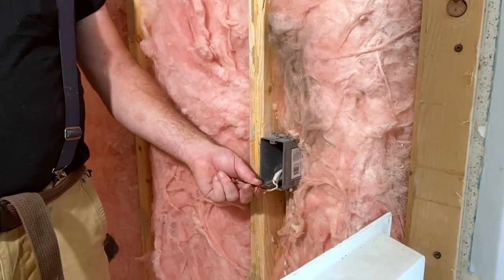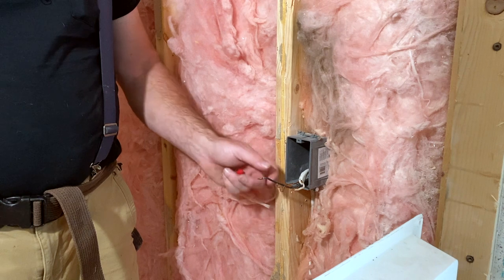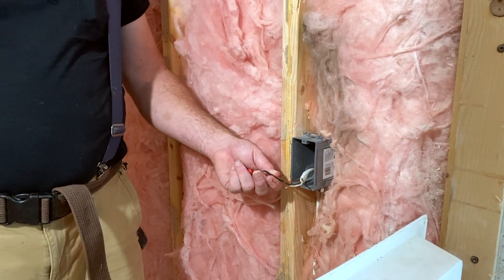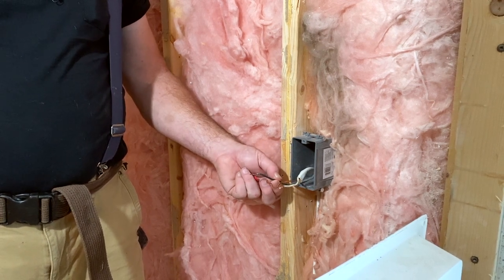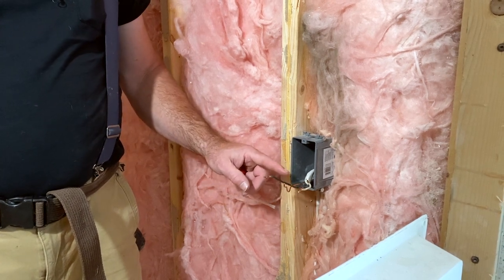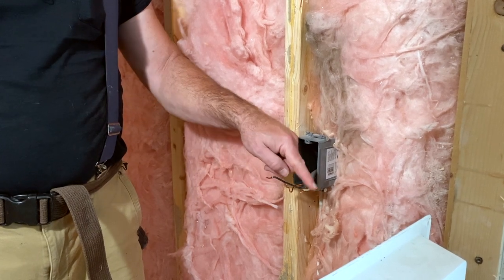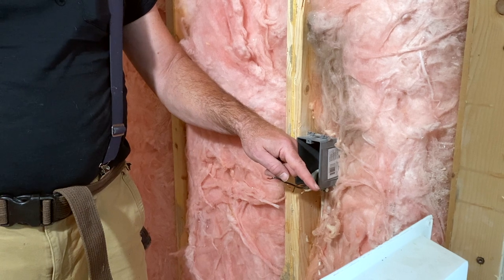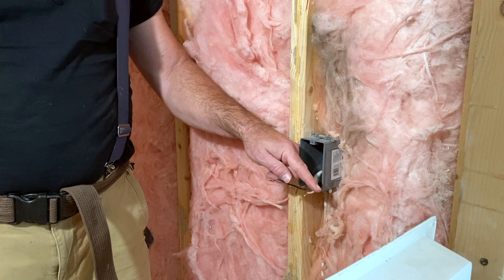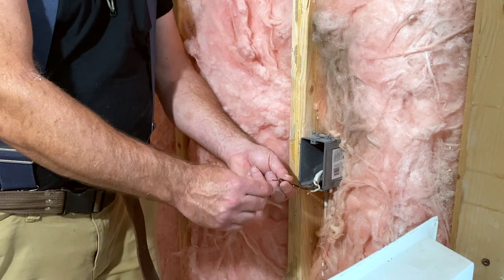This is an overabundance of caution, but you guys saw how this was a live circuit just a few minutes ago. We are going to be sticking a roto-zip in here blind. If these wires are live and we hit one of them, it's a bad deal. If they're sticking out like this and suddenly that breaker is turned back on, these will be live wires. The black is typically the one you're most interested in protecting yourself from, but that's only nine times out of ten. Occasionally this white wire will actually have your power on it — it won't be the common. It depends on what kind of crazy three-way setup you may have with the switch in the room for controlling the light.